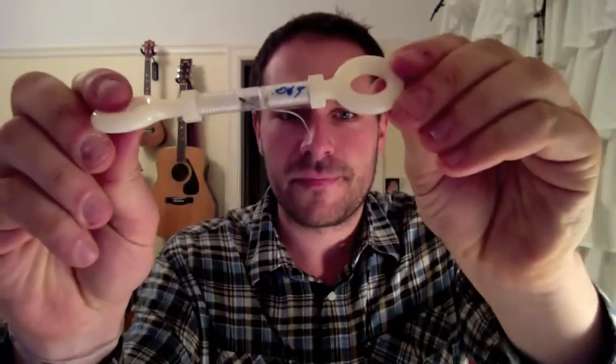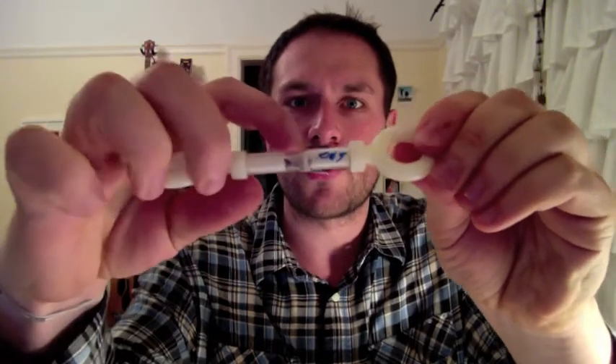You can see here what I've done — I've machined a groove into these new tubes. This is a polycarbonate tube and this is an acrylic tube, and that groove is at least half the wall thickness. The acrylic is more brittle and kind of a pain to machine — if you drop this it'll snap in half when it hits the floor. The polycarbonate is tougher, but maybe it'll be harder to separate during the charge explosion event.